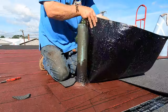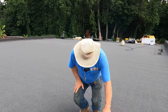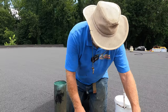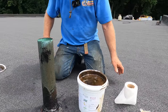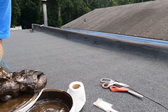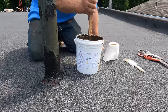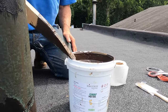Okay, remove the plastic. The fastest, quickest, simplest, easiest, cheapest — whatever you want to call it — roof. You're going to have some obstacles like vent pipes or vents. So what you do is you take a Turbo Poly Seal. You can see it's solidified already, so you take Turbo Poly Seal like that, and you mix it up good. This is an unbelievable material.